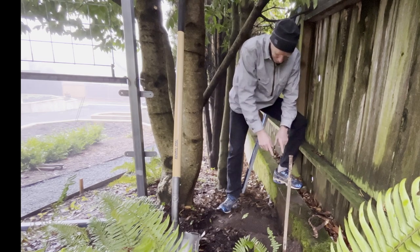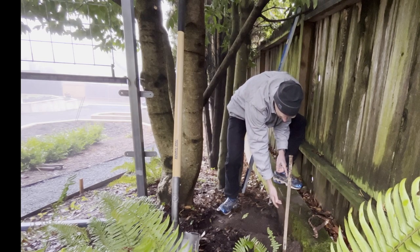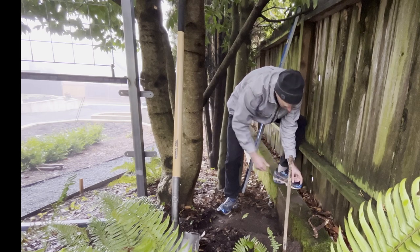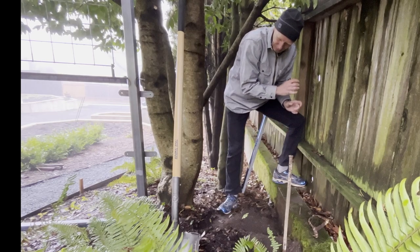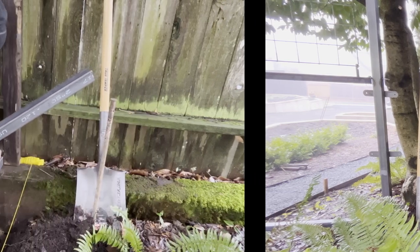So I think I'm gonna build a little L that lags into this side of this wall, which is not straight, and then has a little dogleg over, and then I'll put a post on top of that and tack it in lightly and bend it to get it straight and everything, and then true it up, and then clean it up.